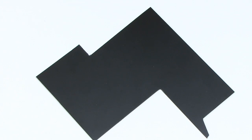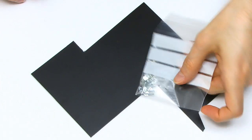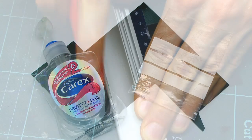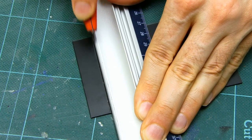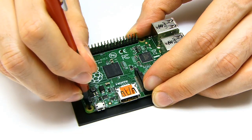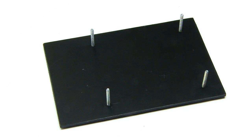I've yet to order a case for my Model B+, but have found a piece of plastic, a packet of tiny nuts and bolts, and an empty liquid soap dispenser. What I'm going to do is cut a mounting board a little bigger than the Pi, sand-smooth the edges, mark the position of the mounting holes, and then drill these out so that the bolts can poke through.